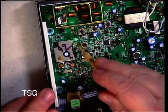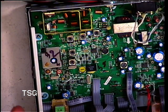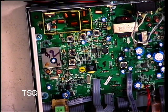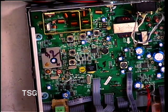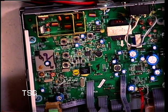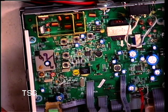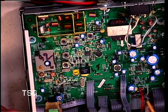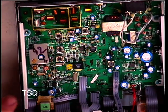So we've done the receiver and you saw it improve. But of course, when you're setting these for 80 channels, you're doing a compromise — you're going to tune them on channel 1 of UK or channel 40 of EU. But because we're only going to be using this on the UK channels, we're tuning in the centre of the UK band. So we've now made the EU band less sensitive, but that's great because it's us who's using it.